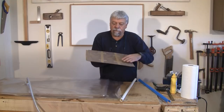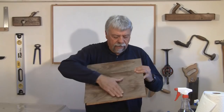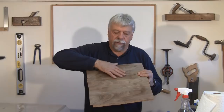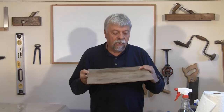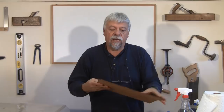The next thing we need to do before we have a finished product is to take the tape off. We simply do that by wetting it down and it'll just peel off. I've now taken all the tape off — still a little bit damp in areas where the tape was, and you might see a tiny bit of residue, which is normal. The next thing now is a very light sanding and surface preparation for whatever finish you're going to apply. It's very nice and flat — still a little bit of flex to it since it's a thinner veneer.